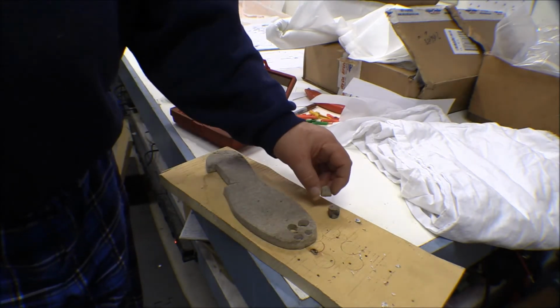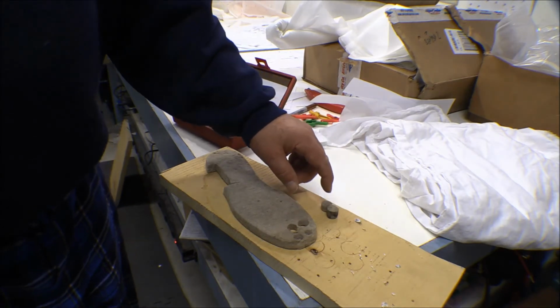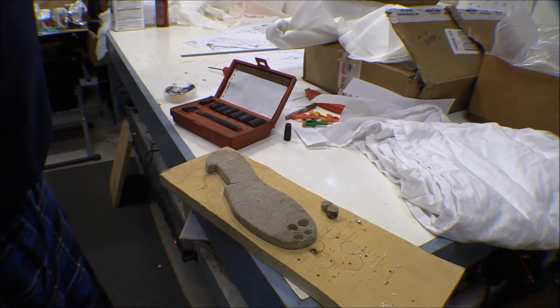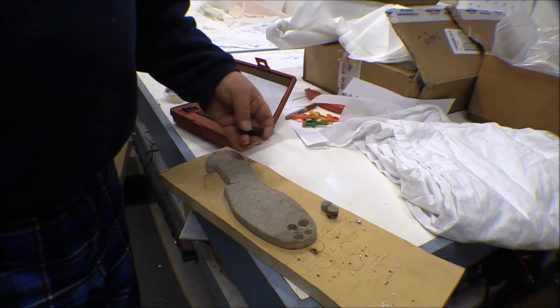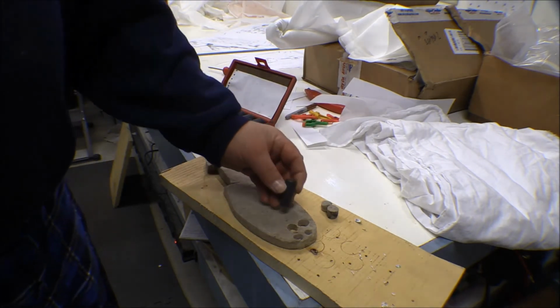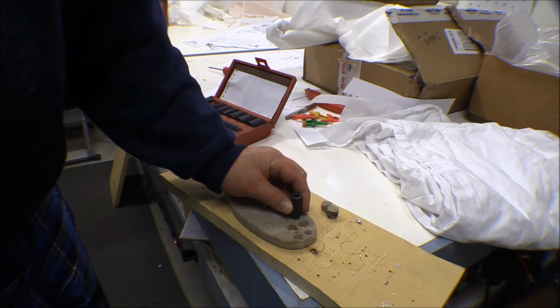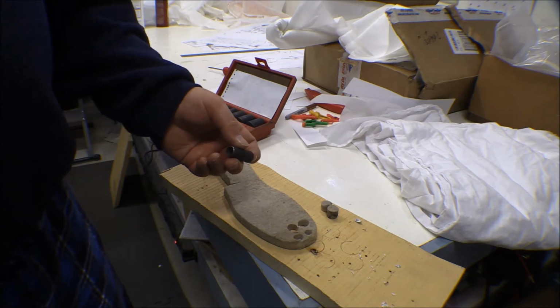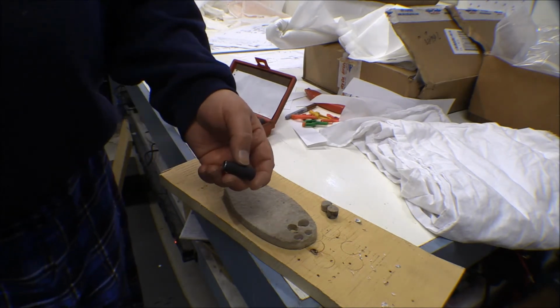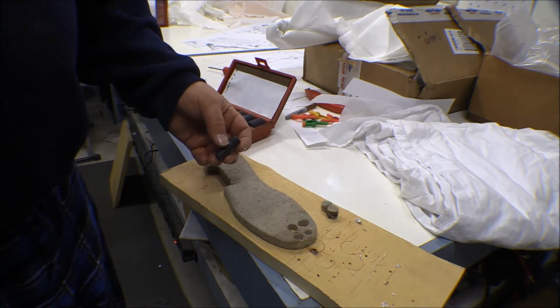Well, I put two pieces of felt in there, and these are the diameter of the inside diameter of that big bushing, and I didn't have anything down in the top of that jack screw itself. So I thought I would go ahead and cut a bushing and stuff down in there, so that could then be saturated with oil, and that would just gradually, like I said, weep out through that little hole and help lubricate that top bushing in that jack screw.